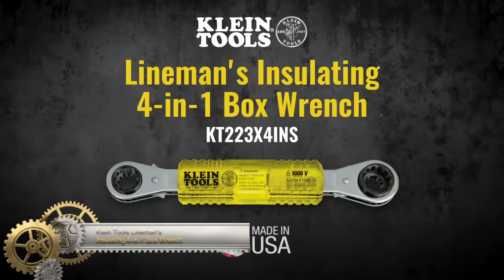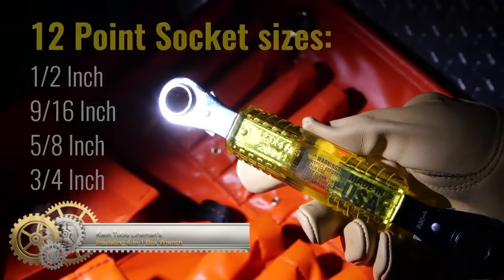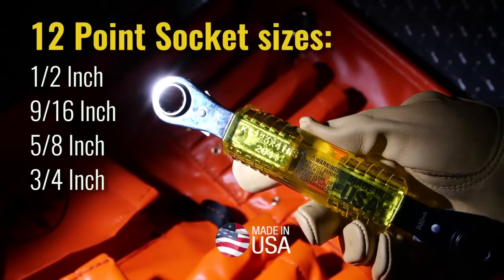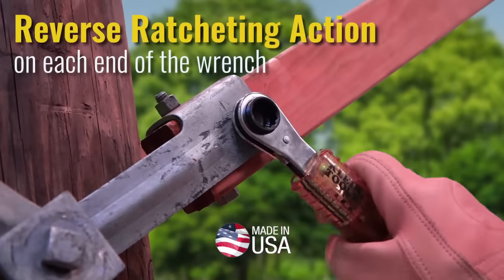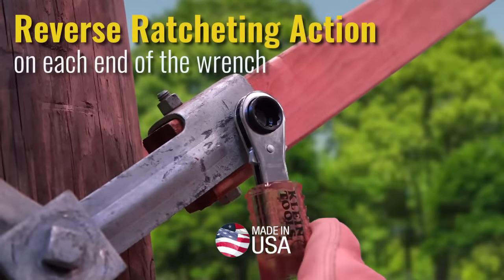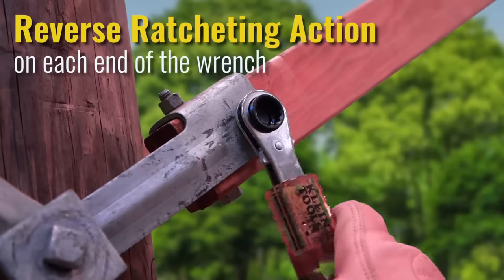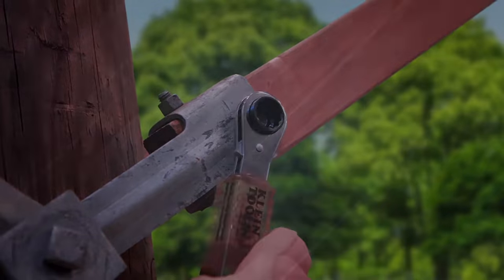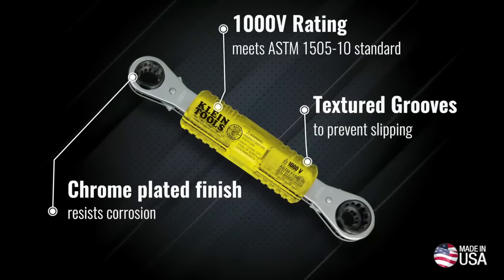The Klein Tools Lineman's Insulating 4-in-1 Box Wrench is a safety-focused and versatile tool for electrical professionals, boasting a 1000 volts insulation rating for working on live wires up to 1000 volts. Its 4-in-1 functionality consolidates four common box wrench sizes, offering convenience and efficiency in a single tool. With a double-ended design, transparent handle for safety confirmation, and 12-point sockets for enhanced grip, this wrench is a compact and reliable addition to any lineman's or electrician's toolbox.